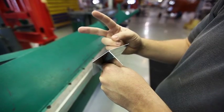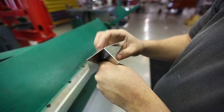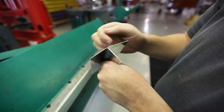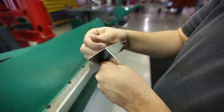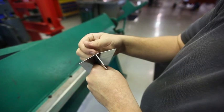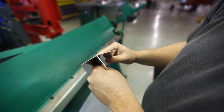Test number two. This is the one without any buffer — our original. This is the one with buffer and setback. And as you can see, the radius is a much smoother radius than the first one. A little more radius there, and that's a better bend for us. So we're going to keep experimenting, but we're getting close.